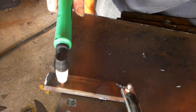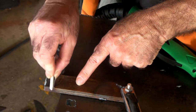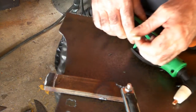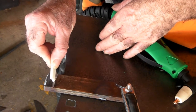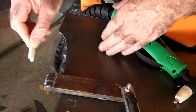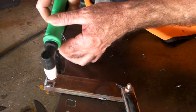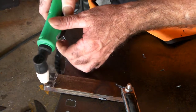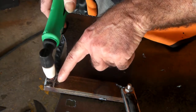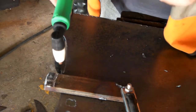So you want to cut this half-inch mild steel bar across there — whatever you want to do. Say you want to cut it, or even cut only halfway like that and leave a piece — don't start your torch from the middle and go that way. Start your torch from an edge and go into there and stop, then go from there down. If you try starting it in the middle to get rid of that square, you'll burn your consumable out before you even get a chance.